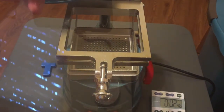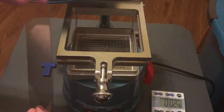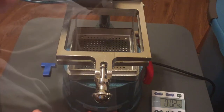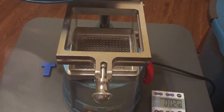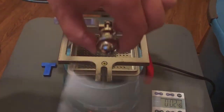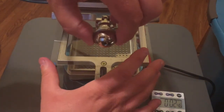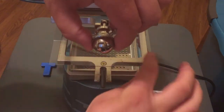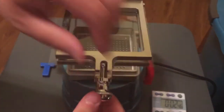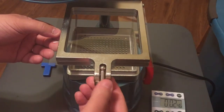This material is 0.020 inches thick, so it's one of the thinner materials you would get. I'm going to take this material and put it into the vise, sliding it in and making sure that it's supported equally on both sides and that the vise can actually close around it.